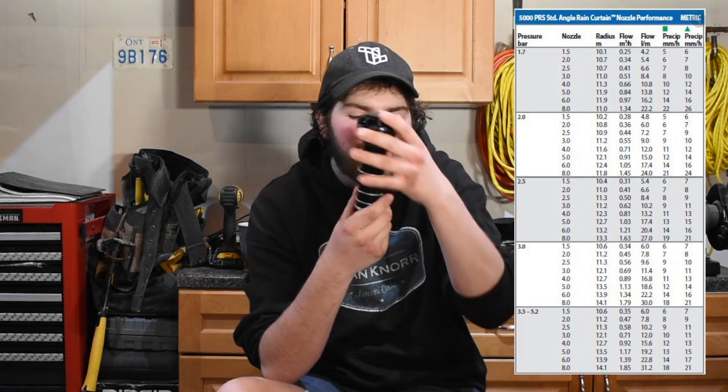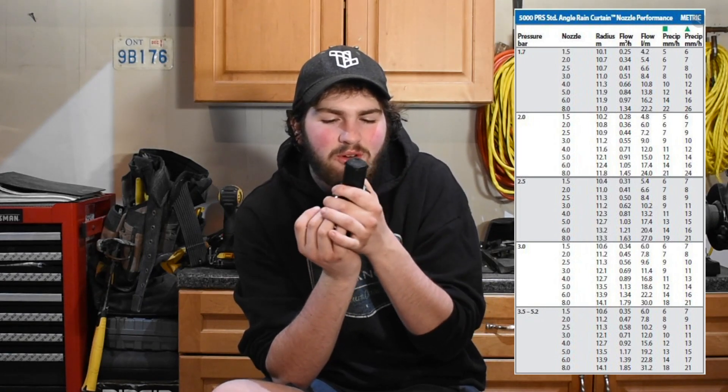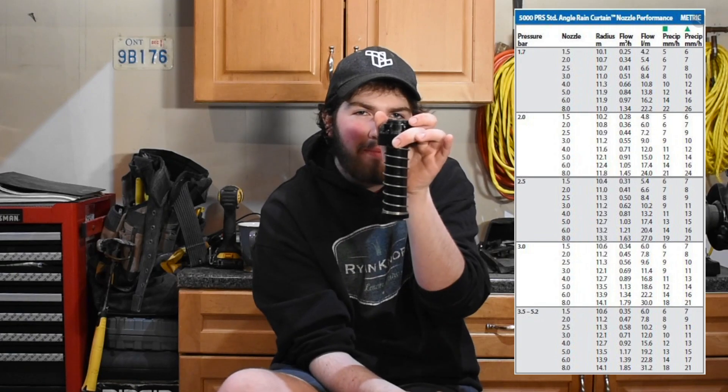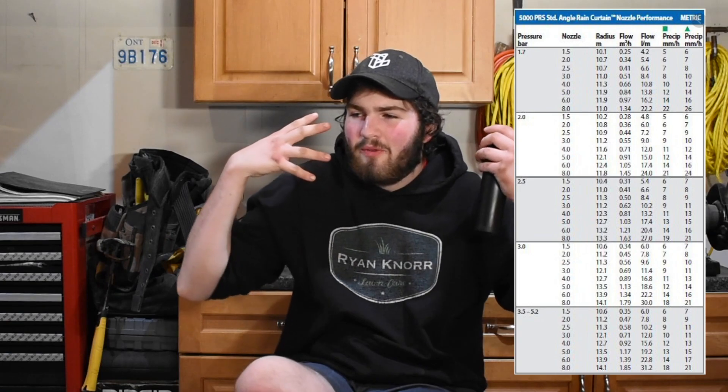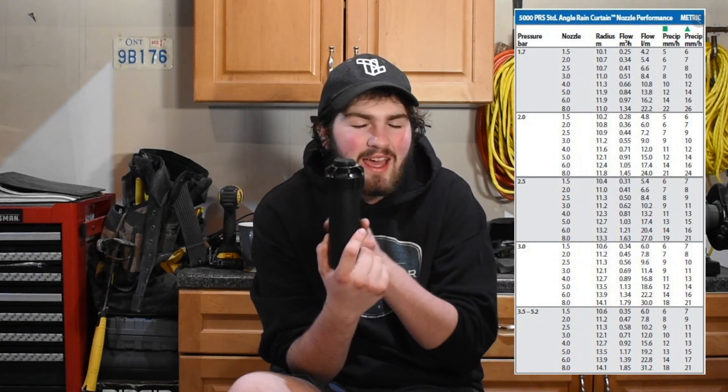The second thing you need to know is pressure. The pressure in the line pushes the head out of the ground, causing them to pop up — and they drop back down when the pressure is released and the water is turned off. You need to know the operating pressure while your system is running. Buy a pressure gauge, take your stagnant pressure, and then normally dropping it by half gives you the operating pressure. In my case, I have six to eight gallons per minute coming out of the house, about 60 PSI stagnant. When the system is running, it drops to about 20-25 PSI — so I have 25 PSI and a maximum of two gallons per minute at each head.